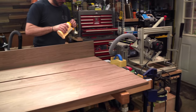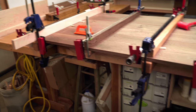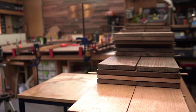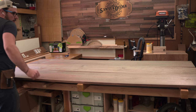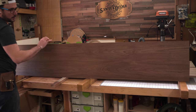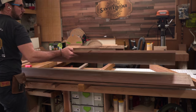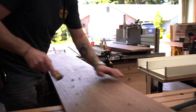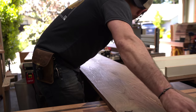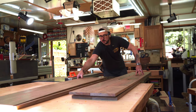The longer the board, the more you're going to see some deformities in the panels after you resaw. There's still some bow left in these and normally I wouldn't let this go, but I wanted to maintain thickness. Since we're using those strong backs it's going to straighten those back out, and if anything a little bow in the opposite direction of the load — having that tension in the board — can do nothing but help in this case.